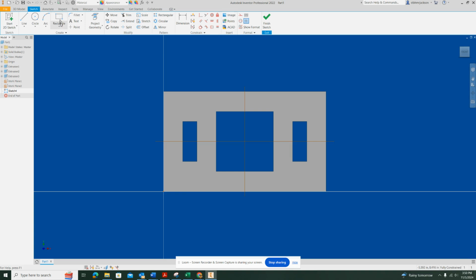Okay, so I'm going to do a line from here over to here. And this one has a measurement on it, so it's 2 1/4 from the edge to the tip of the line. So that's 2.25. And then it has a 30-degree angle on it. So the 30-degree angle is between here and here. So those are really the only two numbers that we need.